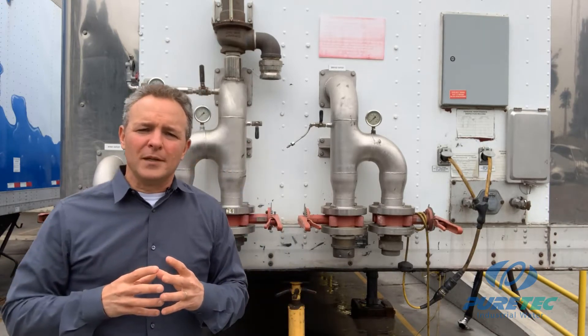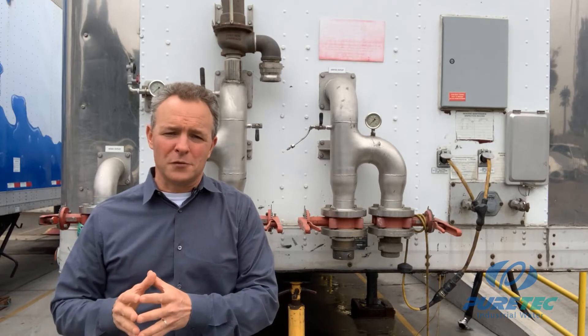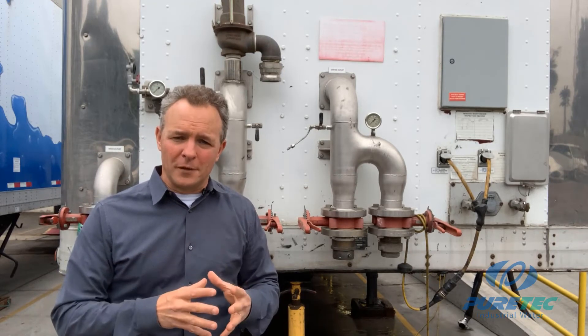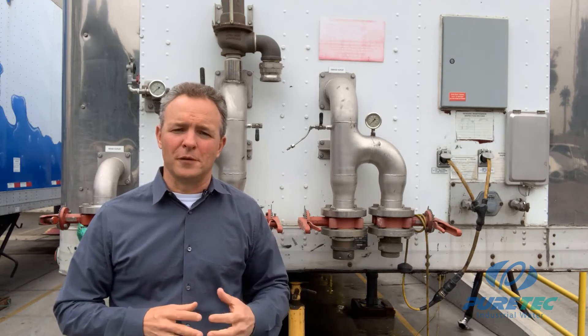The reason for this is if the water flow is 50 to 150 gallons per minute, you can use one hose. If the feed water flow is 150 to 400 gpm, then you would use two hoses to feed the inlet and two for the outlet.